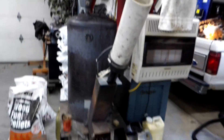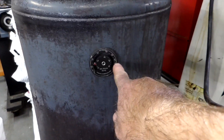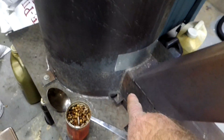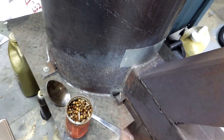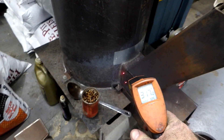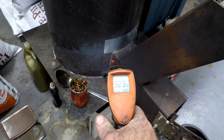Within 20 minutes or so I've got 600-650 degrees on this can. I've had it where if I don't watch the air control, I'll have that burner glowing red — my temperature indicator will show 850-900 degrees. I'm at 327 right now because it's idling. It's 8:30 at night and this building is 70 degrees, so I don't need all this heat.